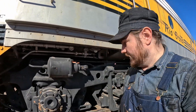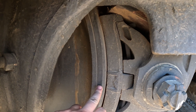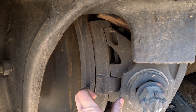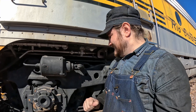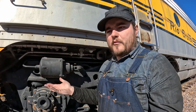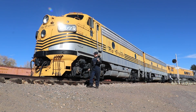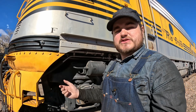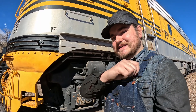Diesels basically picked their wheel size based on how big the engine and alternator needed to be and whatever space was left could be taken up by the wheels. So most diesels have vaguely a 40-inch wheel. On these EMDs, they have what's called a witness groove on the wheel — this little groove right here — so we can actually see that 5771's wheels got turned down pretty far. A full-size tire is usually close to three inches thick. At that witness groove it was 36 inches, and you could cut down the wheels as needed as defects came up and they needed to be trued back to profile. So you're wandering between a 40-inch and a 36-inch-ish wheel as the wheels wore, and that really didn't make much of a difference for the diesel. These days, the most modern locomotives have bigger wheels with AC traction motors because the manufacturers determined that a 38-inch witness groove ended up being a little bit better. But the point is still the same: wheel size does not matter near as much on a diesel locomotive as it does on a steam locomotive.